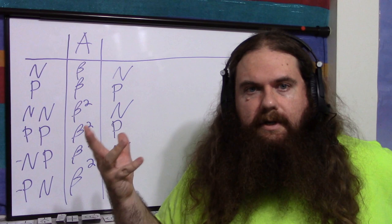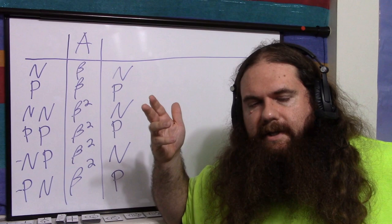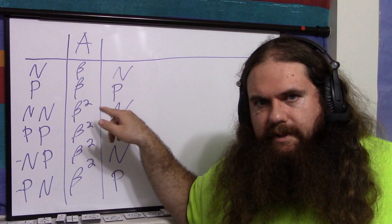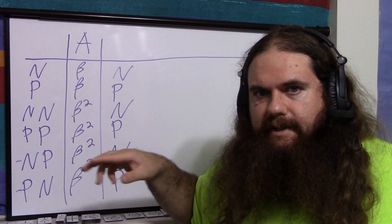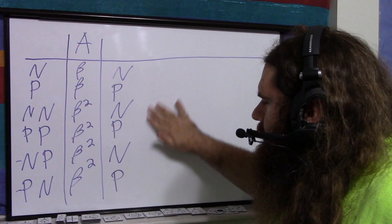You can buy Darlington and Sziklai Darlington chips. If you make an integrated circuit, you can put these on chip. I tried an OTA from Texas Instruments that had a Darlington NPN on it, which I wasn't able to make work — I think I had a Chinese knockoff. But I've done this with discrete transistors and I'll show you in another video with my breadboard. In the next video, I'm going to do actual electrical examples. Just keep it simple: doing this gives you the same kind of transistor with a different gain. Don't overthink it. Next time we'll actually analyze the efficiency with numbers and real electronic characteristics.